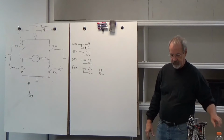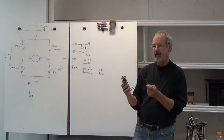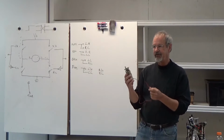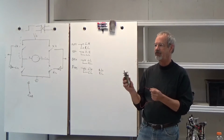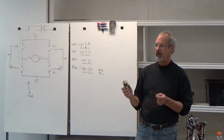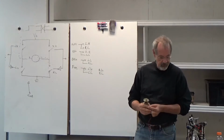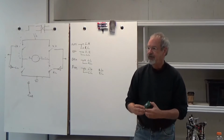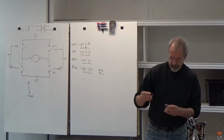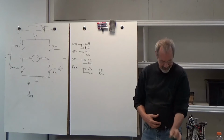And Richard makes a good point, which is we take a motor like this and essentially just measure the resistance when it's not turning. Then the voltage you put in divided by that resistance is the current that this thing is going to require when it's stalled. Electric motors are interesting in that they have the maximum torque when they're at 0 speed, when you're just trying to turn. So you have to be sure that whatever device you're using, you say, well, it turns out our stall current's 2 amps and this is a 1 amp device, this is not going to do. This might help. There you go, 2 amps. Yeah. Put a heat sink on it.